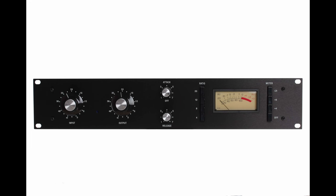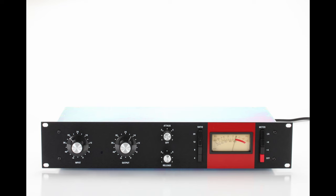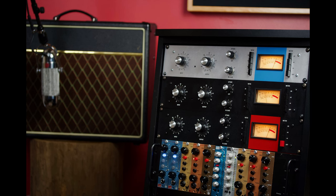This results in a little more distortion which defines the blue stripe sound. The Rev-D is considered the most classic FET compressor sound and what most 1176 hardware revisions and plugins are based on. The Hairball Rev-D has the functionality of Rev-B through Rev-E units. These units use a bipolar transistor as the first active component and introduced low noise circuitry. The Rev-F is cleaner than the A or the D, giving a more glossy, polished effect on your source material.